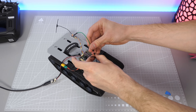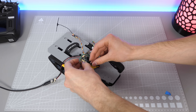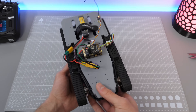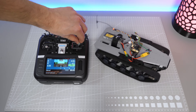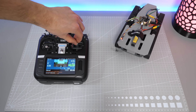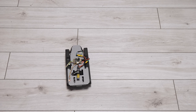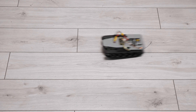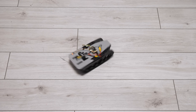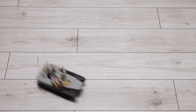To start up the rover, I first connected the Arduino input wires to the defined servo outputs on the Kakute flight controller, and then I strapped in a 2S high voltage LiPo battery and let the rover run free. Our modifications didn't harm the rover performance — I would even say that the new driver and high voltage battery gave it a lot more power. But at this point, it's still just a toy. A very fun toy, but a toy nonetheless.